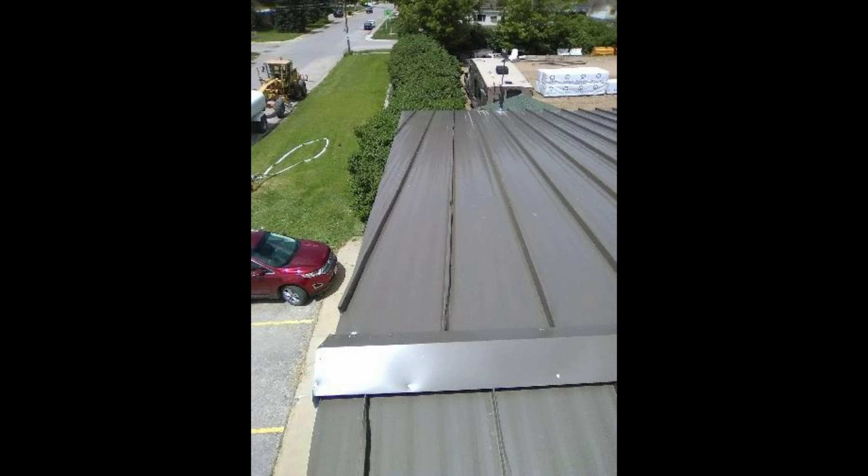This is where you don't necessarily need to run perfectly square anymore. You're pushing and prodding the panel, getting a little bit of play in that panel to square off with the opposite rake. Each panel has a little bit of play, so you can grow or shrink the eave or grow the ridge to line out with the rake on the far side.